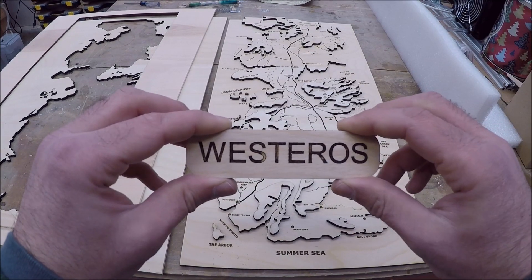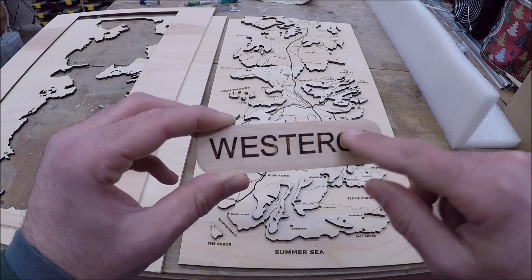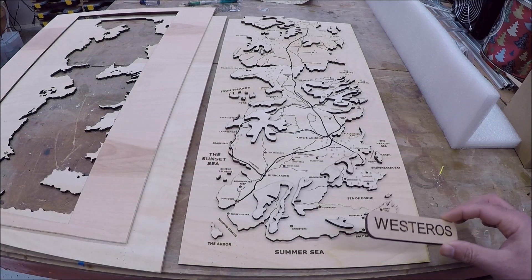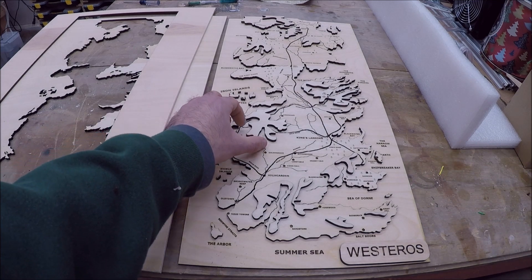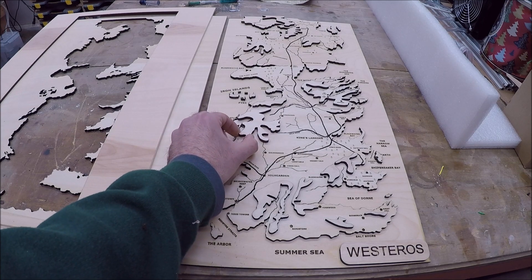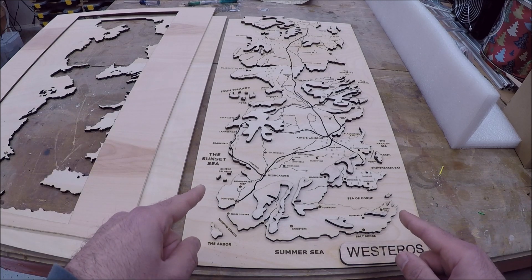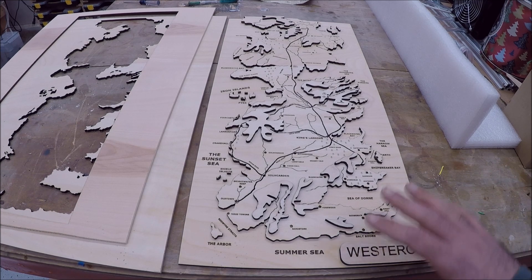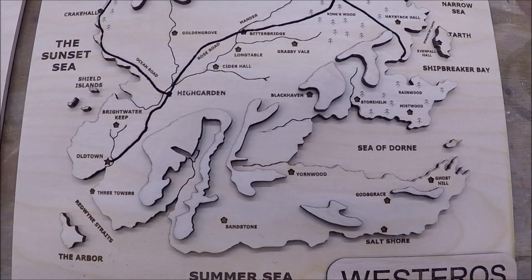This is what the finished product looks like. I took it out of the laser cutter and used some 320-grit sandpaper on it, then hit it with compressed air to clean all the dust out of the grooves. It's the last piece I needed for my Westeros poster — a 3D model of Westeros where I cut all the pieces out with the laser cutter. I was able to create the file and cut it all out in two days of work. Lightburn was key to getting something like this done. Hope you enjoyed the video and learned something — thank you for watching!